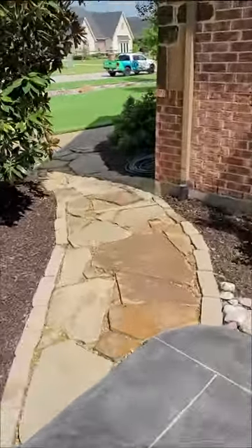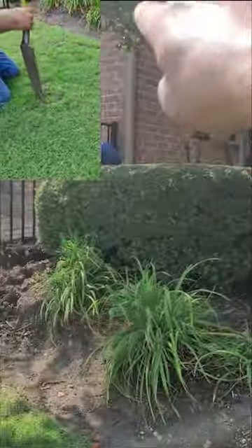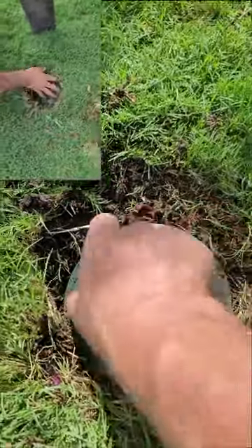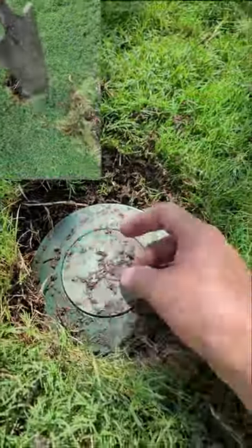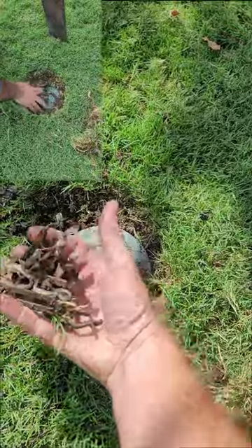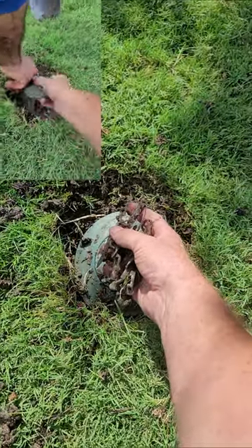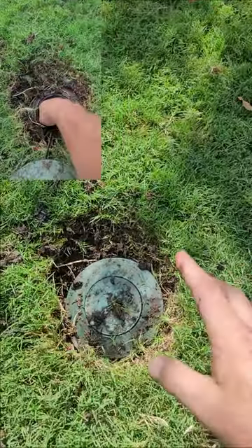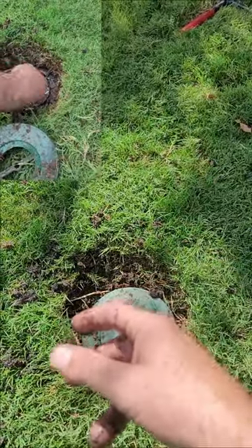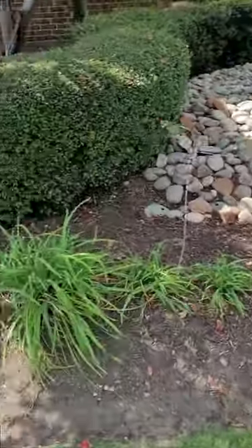The problem is — I'll show you in a minute — when we got to this house, the pop-up emitter from this downspout over here was completely covered in grass, meaning the pop-up feature could not pop up. Very little water was getting outside the pop-up emitter. When we opened it up there was even more debris inside; something had landed in the gutter and got washed down. If debris knots up in front of the emitter and leaves get behind it, the water coming out of the downspout has nowhere to go — it'll spew out right below the downspout.